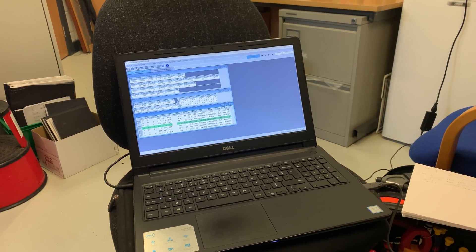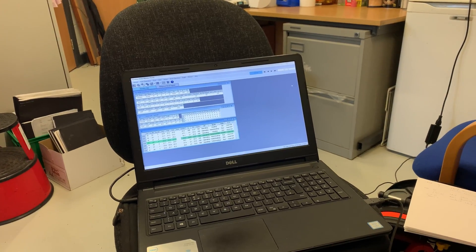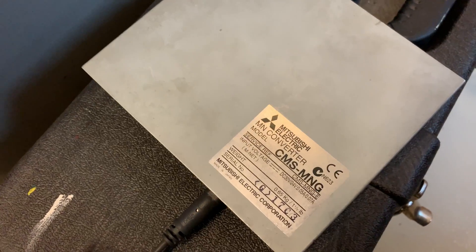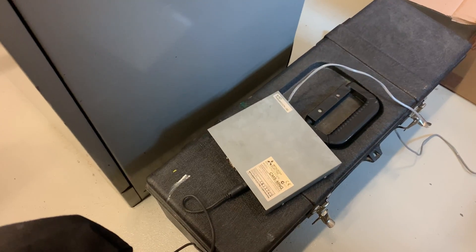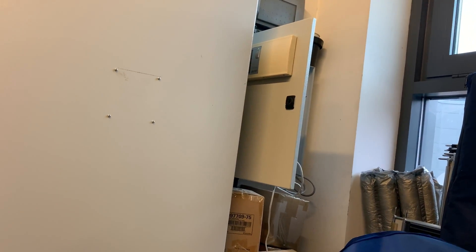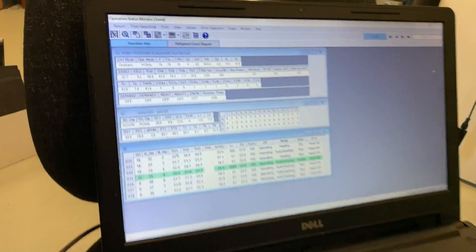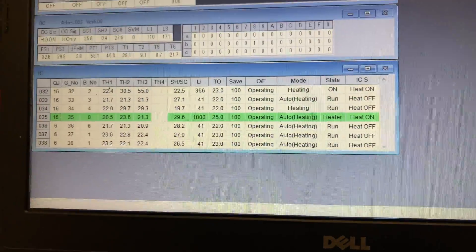Right, what's happening people - I thought we'd do a quick little video because I'm just doing a bit of maintenance on a decent size site. It's all Mitsubishi Electric kit, and that there is the maintenance checker for the City Multi VRF kit. You can plug it anywhere on the M-Net. There's a central controller up there; I've just plugged it onto the M-Net in there, easier, and then we've got it hooked up to the laptop.